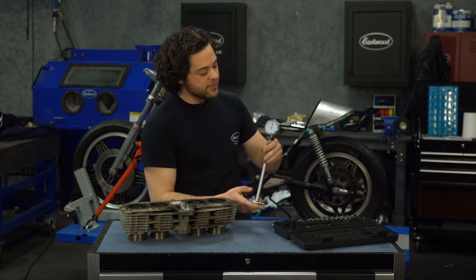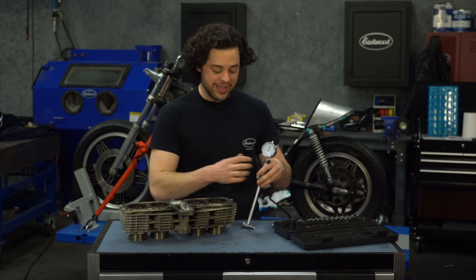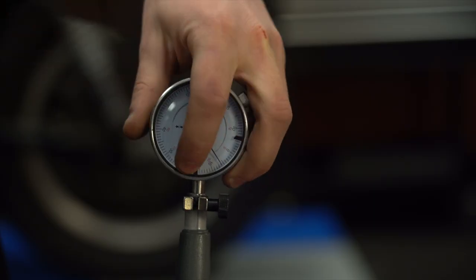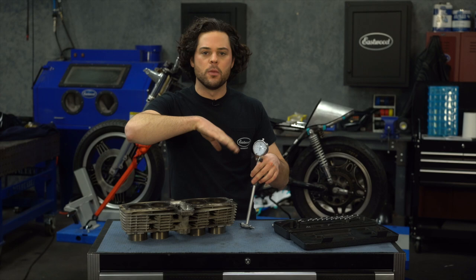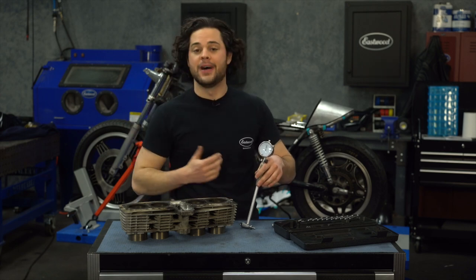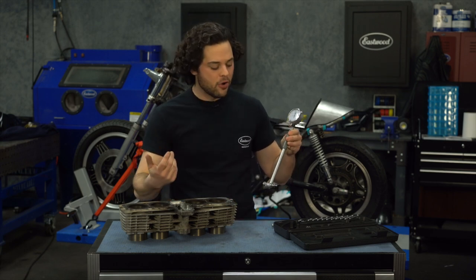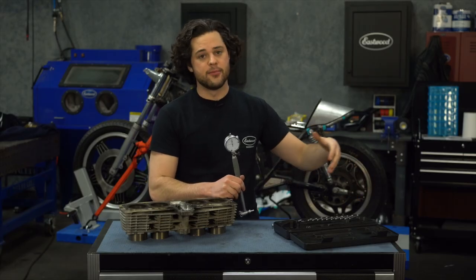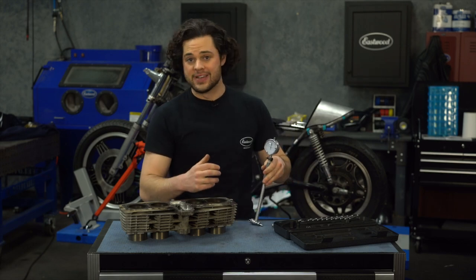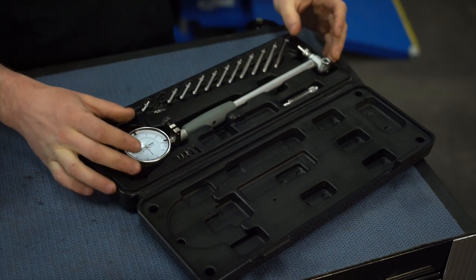But back to the bore tool — a couple of other things I didn't mention here. Obviously you get a nice legible black and white gauge, but you also get some min/max rings. You can adjust those and slide them around where you want your min and your max to be, or if you wanted to stay within a certain range, you could set that and just make sure the needle bounces between. Nice little touch right there. Obviously you get a nice long handle with a little grip at the top as well — great for reaching into those deep cylinder bores. And also, one thing I didn't mention: the kit includes an extension as well, so you can really do those big blocks, those wide six-inch cylinders with the right setup of shims, pins, and that extension. All good to have, and on top of that you get a nice blow-molded carrying case which keeps everything nice and organized when you're done.